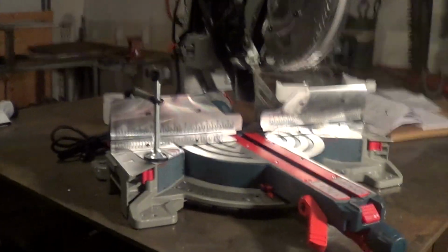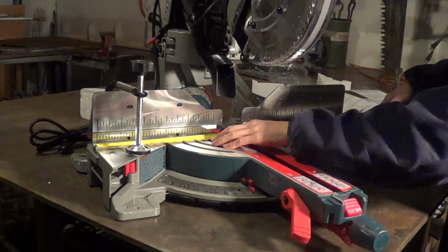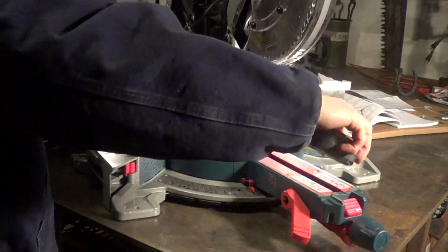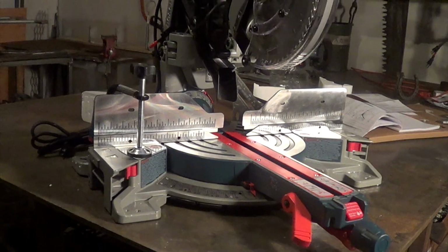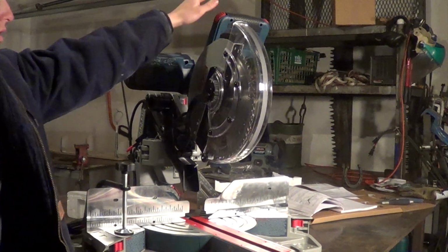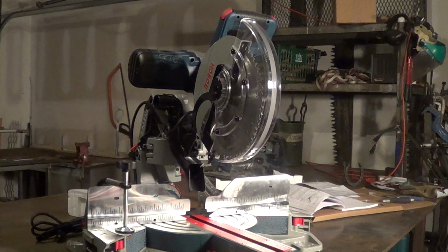If you're curious about the measurements, I'll give them to you one time, just out of the box. I think I gave you the workbench measurement. Contracted is about 26.5 inches. Now, total depth-wise, you're talking about 33 inches from the very backbone of this saw to the tip of this adjustment knob. And height-wise, without it being locked down, from my workbench to the tip of the handle is about 27.5 inches.